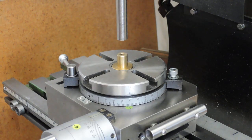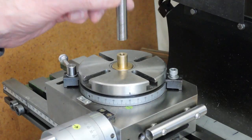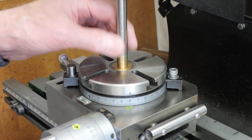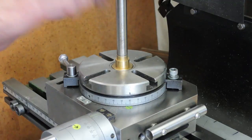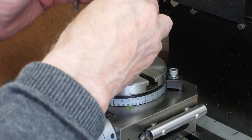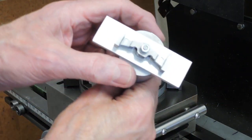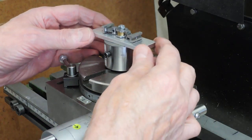The first job is to get the rotary table centred. I usually start by having a piece of 12mm bar there and this fixture, and I'll just move the table around until they're parallel. You can sort of double check with a ring there — so we're in place. That comes out, and then this is the fixture I'm going to put in there, and I need to get that aligned.